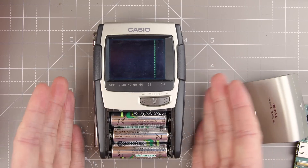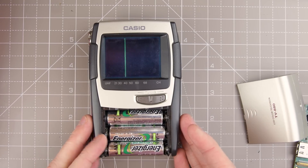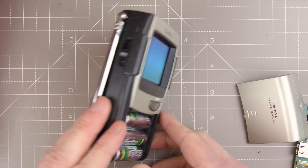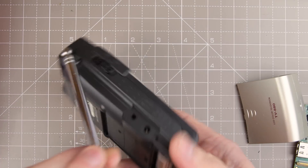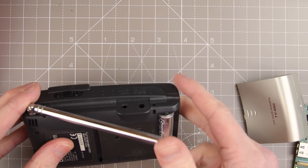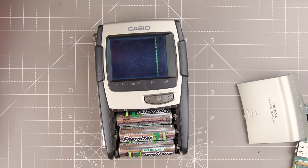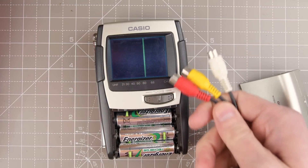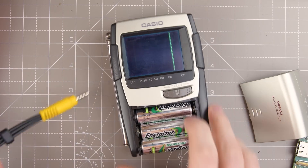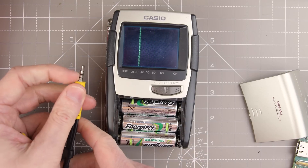The brilliant thing about this little TV, which works on the analog frequency we used to broadcast in the UK and no longer do — similar to loads of countries around the world — is that underneath the aerial there's a little hole for DC in but also for AV. So that's your composite video jack. It'll accept these kind of video jacks. I've got some that go onto a four-pole 3.5mm jack, which is the kind of connector this thing has, but it seems to be a bit proprietary because it's not the same order.